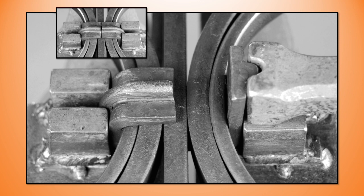As I've made a special set hammer which accommodates the bead, and you can see that here. Here's my set hammer, and this is to accommodate the bead. I can stretch the collar material. I can take the set hammer, just place it on here, and I can just squeeze out that and close. You can see I've got my little gap here. I can just close the top surface of my collar. Not going to get down to the root, but I just need the visual surface closed. So if I'm a little short of material, I'm talking a little, not a lot, then I can close it.